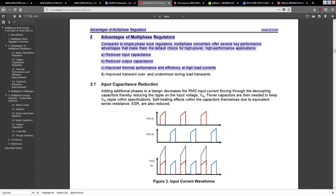Using a proper doubling scheme gives you most of the multi-phase benefits: reduced input capacitance, reduced output capacitance, improved thermal performance, and most of the transient response improvements. Gigabyte's design only hits the thermal benefit from parallel MOSFETs — that B450 board doesn't even achieve that fully because they dropped the high side MOSFET. If you use a doubler, you get benefits A, B, C, and most of D. If you just parallel components without a doubler, you only get C — improved thermal performance — and nothing else.